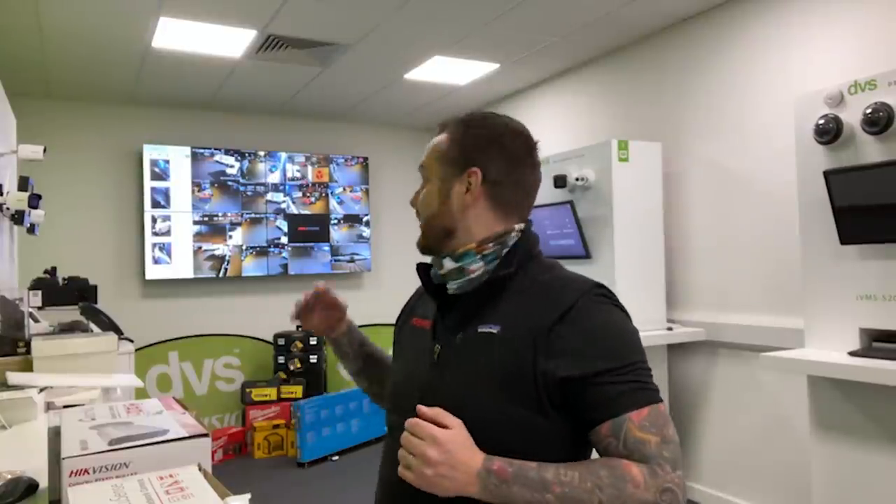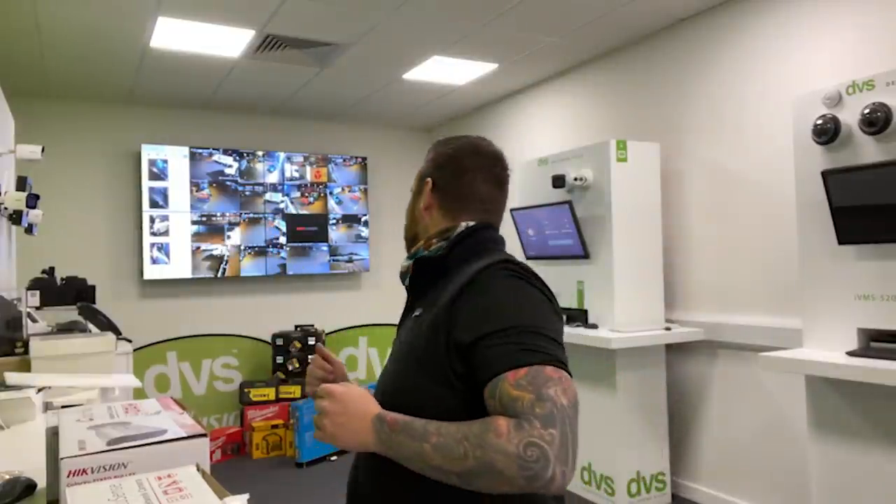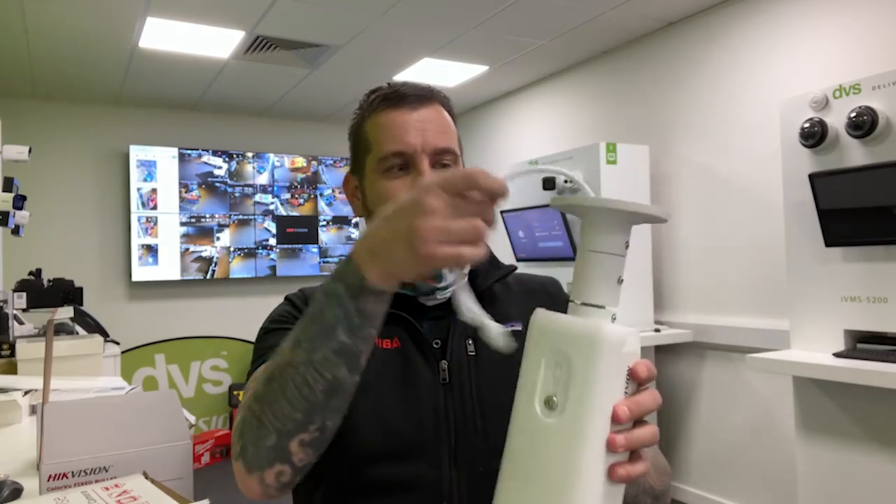I'm really excited about doing this video tonight. As you can see it is dark outside — it's quarter to six already. We're going to fit this bullet camera as we talked about earlier: two white lights on the front, fixed lens, 2.8mm, 4 megapixel, adjustable bracket, sun shield, fly lead for PoE or 12 volts. Very simple. We'll strap that to the temporary mount and show the benefits of the technology first without the white light, then with the white light, so you can see the comparison.